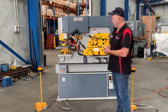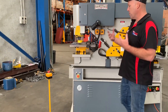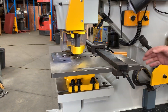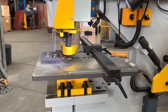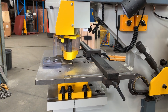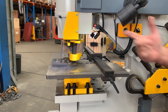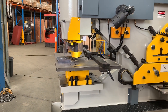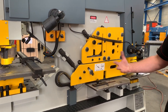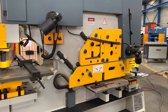Some of the key features of the Multi 70: we've got a 450 deep throat, so when you're doing your plate work it's very handy to have that extra deep throat. It's generally a 20mil capacity machine — when you're punching it'll do a 26mil hole in 20mil plate, and when you're shearing it'll crop 300 by 20mil plate. So it's a 20mil all-round dual cylinder machine.